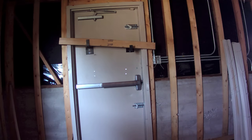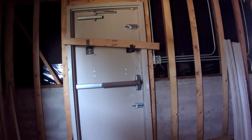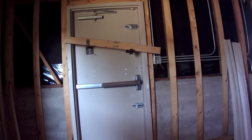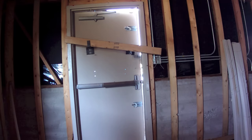Very rarely do these just quickly get driven off the back side. You need to go back and forth, working one bolt and dropping down to the other bolt, and not getting focused in on one single bolt. It's rare that they drive right through the door like you see in videos or on props if you've done it that way before. Once they're mounted on an actual mount, it's difficult to drive them all the way off the door. Once we've defeated it, we go back to conventional forcible entry and break the drop bar.